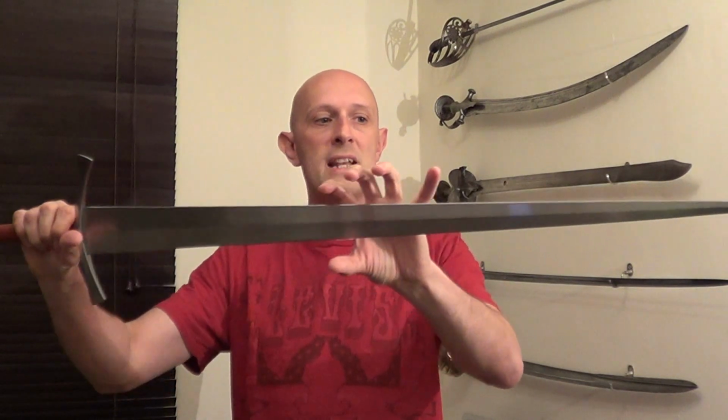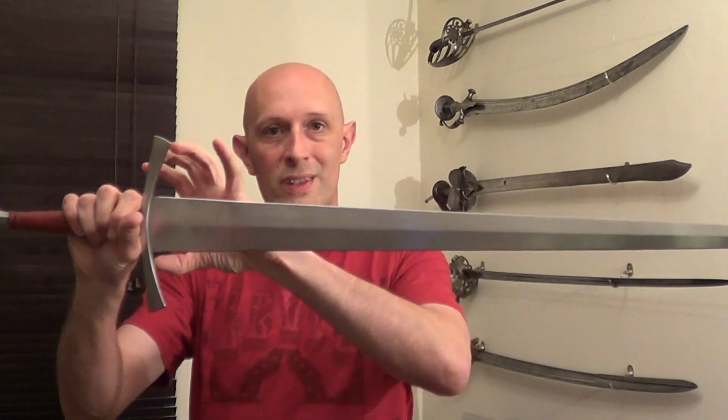Okay, basic Newtonian physics. So, firstly, the fact that the blade is very broad and tapers to a point means that you don't need very much distal taper, because you're already going from having lots of metal up here to less and less metal until you have zero metal at the point. Okay, so essentially the taper is in the silhouette, in the shape of the blade this way. You don't need, therefore, that much taper in the blade that way.